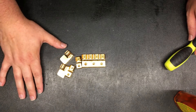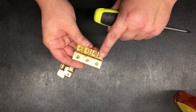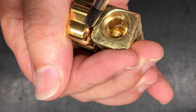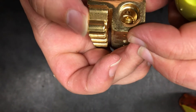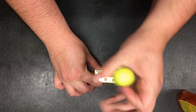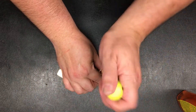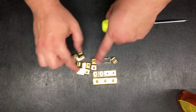The back of the plastic case is cleaned up. Now we're going to take all of these screws out. Pay attention — hopefully this will zoom in — you can see this part here has a little opening, and this side is flat. We want to make sure those openings are going to be facing towards the power side. All of these screws are the same size, so it does not matter where they go.